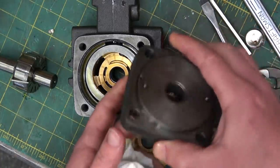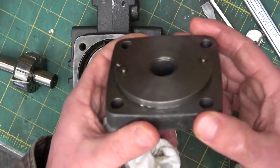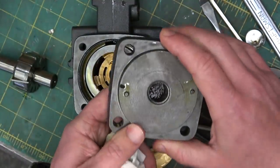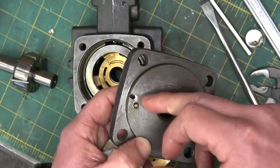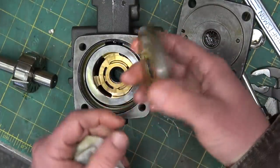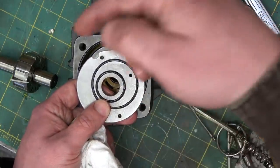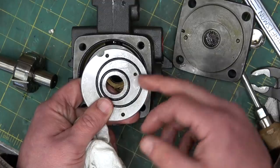Going through the internals — on the cap end here we have some porting to take any bypass flow that sneaks through this DU bushing. This is a special kind of bushing — a very light sleeve that is Teflon-lined, then a bit of bronze and then aluminum. It just gets pounded in there and that's the bearing itself, lubricated by the hydraulic oil. Anything that leaked through would go back to the input side — low pressure on the inlet side. Same thing on this plate: some O-rings, some offset O-rings, and porting here to take any bypass flow and port it back to the inlet, the low-pressure side.